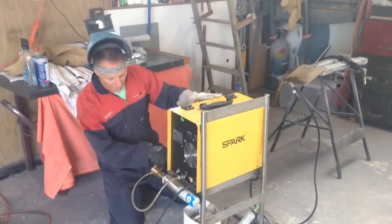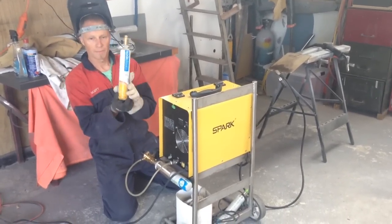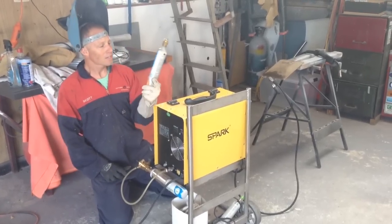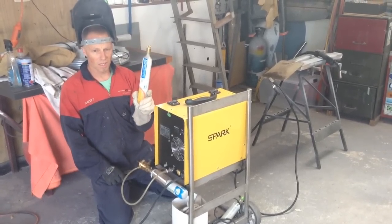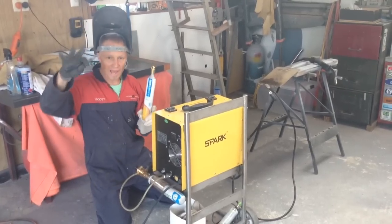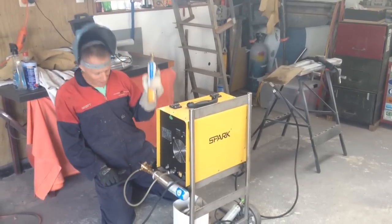Here's the big secret — I'll stop waffling. Sodastream CO2 is the perfect shielding gas for welding. A CO2 bottle, brand new in New Zealand, costs $40 to buy and you own it — unlike the Argon or Argo Shield that you have to rent on a monthly basis.